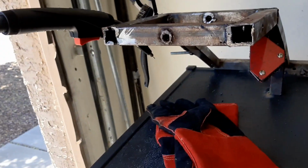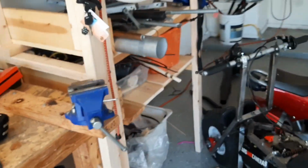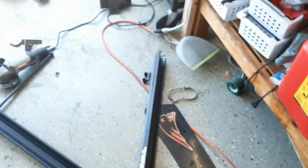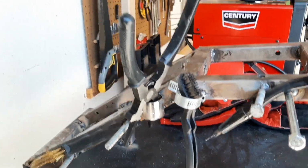There is one problem though, especially with flux core. There's a lot of waste smoke. Do the research. Make sure you're not welding certain materials that can actually cause lung cancer. This kind of galvanized stuff you can't weld without grinding every single millimeter of it down, or it'll produce zinc fumes, which I'm pretty sure will kill you.